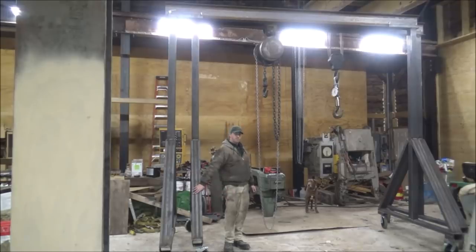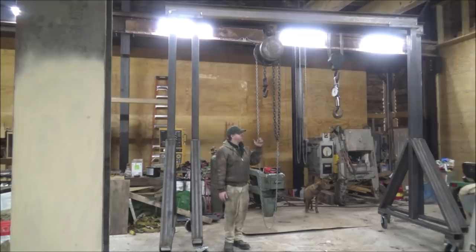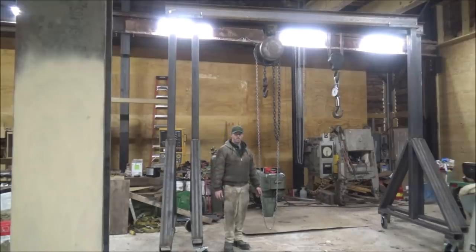And hopefully you've enjoyed the build and getting to see all the testing that was done to verify that what I think they are is what they are, and to be sure that they're safe, that there's nothing defective about it. And they both passed the test with flying colors, tested both of the cranes individually, the max loads, 6,000 pounds in the middle, and then it had the oven on this other one at both ends, and that's like 5,000 pounds between it and the hoist, and me, or at least 4,500 anyway, so it's definitely good for the 4,000 these are rated for.